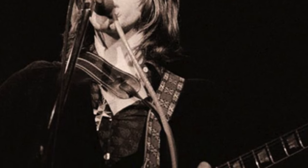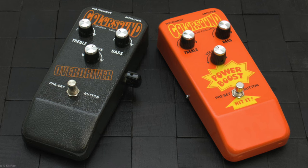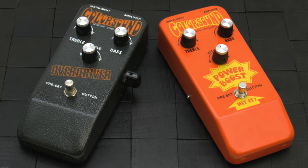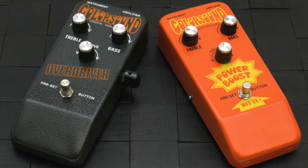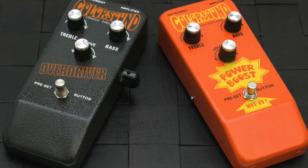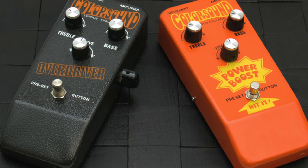Let's have a look at Jeff Beck's pedals through the 1970s. In a photo from 1972 at a TV studio, we can see Jeff with a bottle of beer and a Colorsound Overdriver pedal. The Colorsound Power Boost and Overdriver are pieces of British fuzz history that were very popular in the 1970s, generally acknowledged to be one of the first overdrive pedals on the market, sold by Macari's Music Store of London. These were essentially pre-amplifiers with a bass and treble boost, designed to drive amplifiers into overdrive or fuzz, and they were loud. The Power Boost was the original 18-volt version of the circuit, later changed to run on 9-volt power and renamed Overdriver. Jeff was a Power Boost and Overdriver user, and it can be heard all over his early 1970s studio recordings and live work, including the Blow by Blow album.